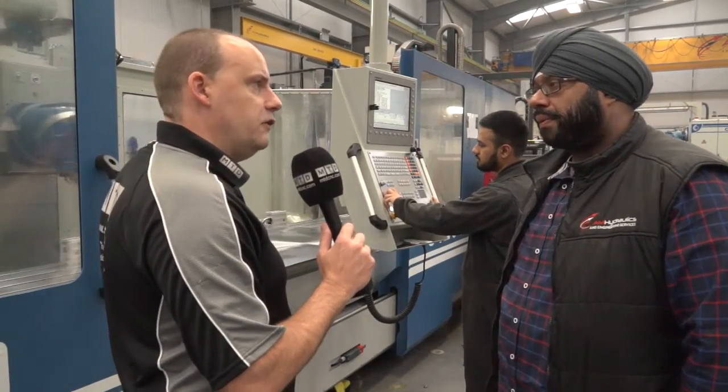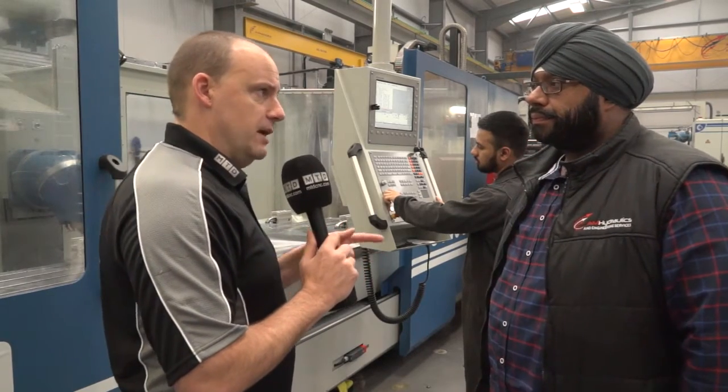And with this head here, does this index to two and a half degrees or something like that? Two and a half degrees, because it's a geared head. That's impressive — so this is a geared head. Does that give you more flexibility in machining as well?